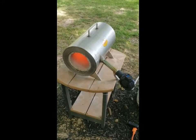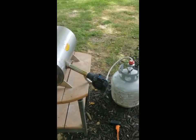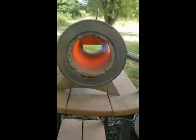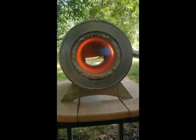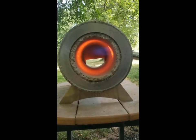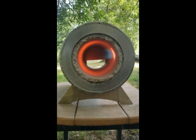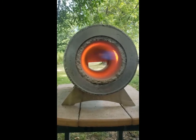Alright, we're back. It's been about five or six minutes. We've increased the gas all the way up, the air has gone a little higher. We've got a nice stable blue flame in there. You can see as we add more gas it'll get hotter, but it will cause more scale. Just slightly reducing there — goes to a bluish green. Right there is just about right.